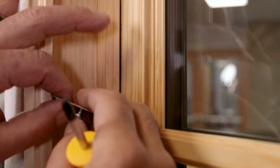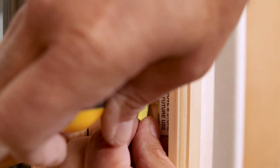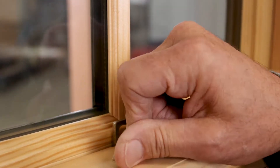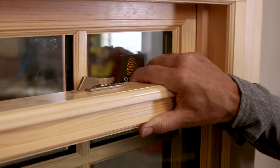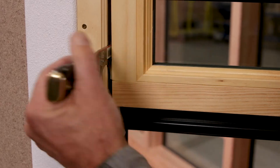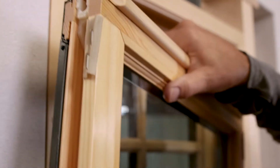I'm going to go ahead and install this using a Phillips head screwdriver, and rinse and repeat on the other side. Unlock the sash. Raise the sash, and it will capture the balance tubes. Pry it to one side — I want to capture that by friction — and then you remove the sash.